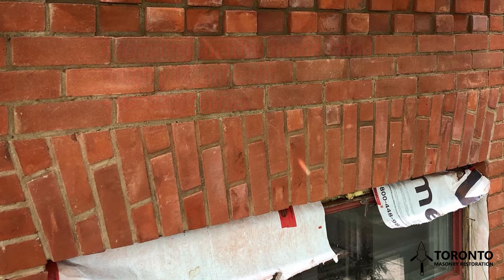When building up the sides, lay your brick towards the opening so that the last brick you lay is the skewback. Dry lay the skewback and mark the bottom of the brick with a pencil where the cut will start.